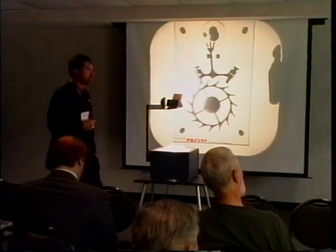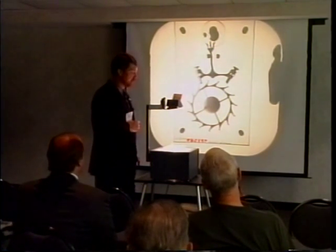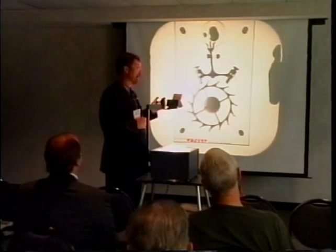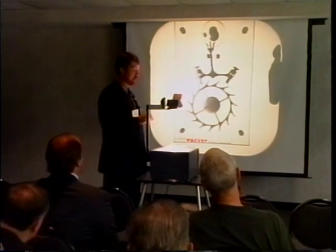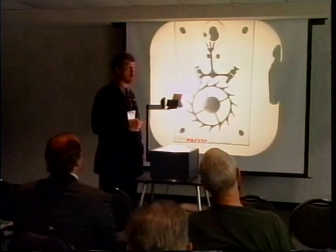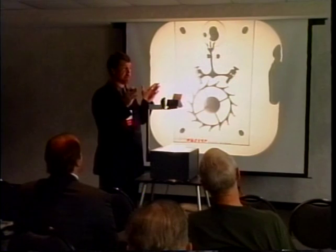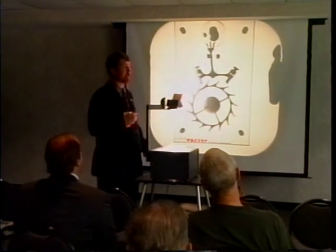If it's unsafe, you correct it by moving the stone? Well, if it's unsafe, you want to go back and check the amount of your stones. If you have movable banking pins, you might want to check the amount of your fork horn clearance to make sure. Point is, you want all your tolerances to be the least amount possible.